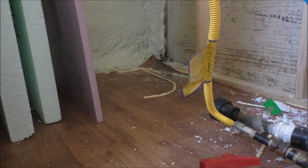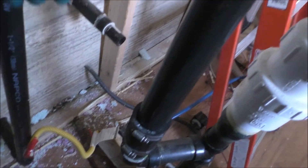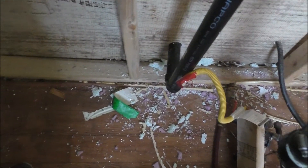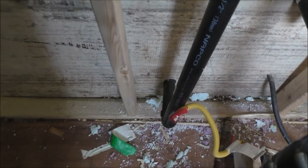Yeah, she's pretty gross guys. I should have a light — it's the same exact leaky-through situation. I'm gonna have to cut the foam back a fairly wide swath, then bleach and foam, and probably be pulling these 2x4s right out — maybe even to this part because of how nasty it is. There's no point having a ceiling back here anyways. Look at this — I can take the whole thing out, the studs, because it's so rotted.